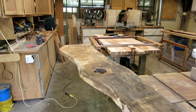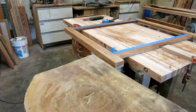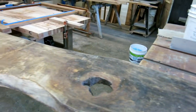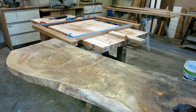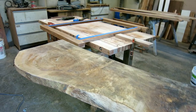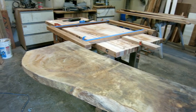That sycamore is pretty gnarly and will be the fill to go into the ends of the beds. It's too wide to go through my planer so I'll have to cut it. In the background the bed frame is clamped to the table, centered and square, and on the right end is a board that projects out, also square with the bed frame and centered.